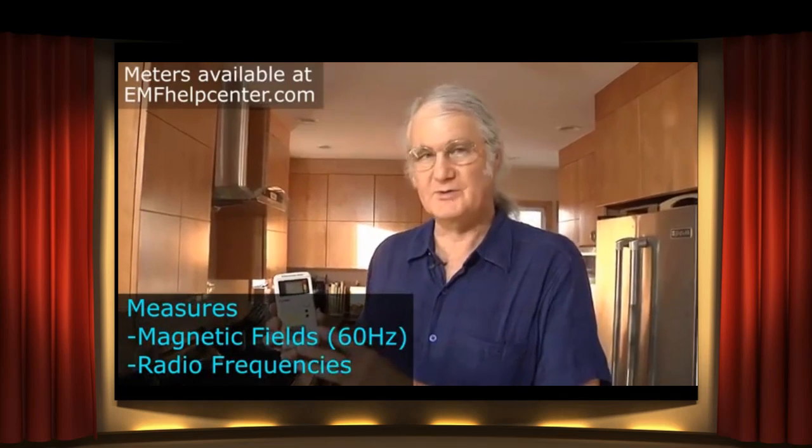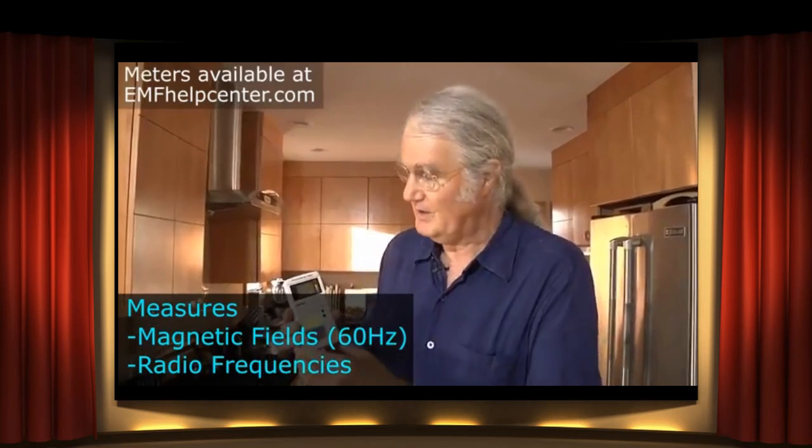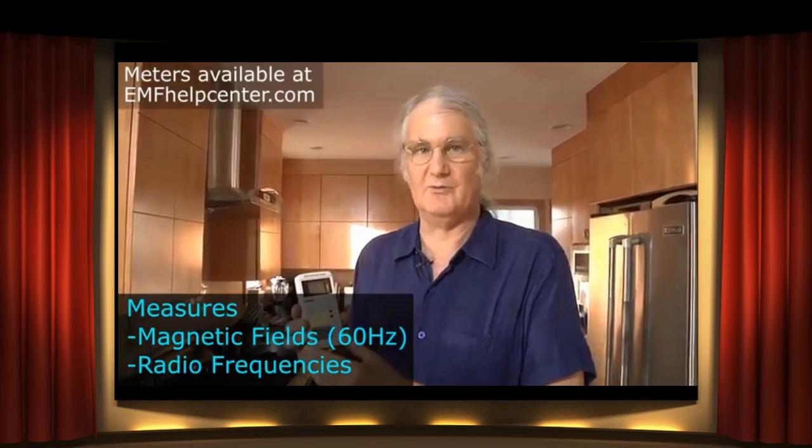Anyway, I'm going to use a little video clip, the link to which you'll find in the description, to introduce you to our meter. These are affordable meters that will help you to measure electromagnetic fields in your home. And this meter here is the Cornett ED78S Electrosmog meter, which actually has two functions, and it measures two different EMFs. The first is extra low frequency magnetic fields at 60 cycles, which is the magnetic field of house wiring. And the other EMF that it measures is radio frequencies. There are 4 types of EMFs that the building biology profession recognizes, and you need different meters, or again a combined meter at different settings, to measure each one of these.